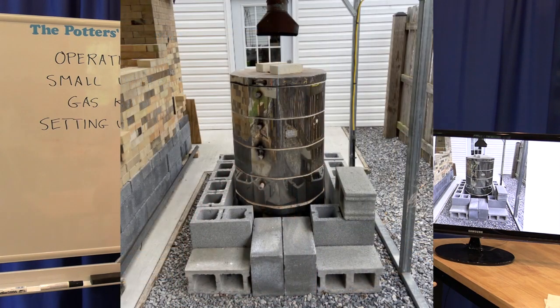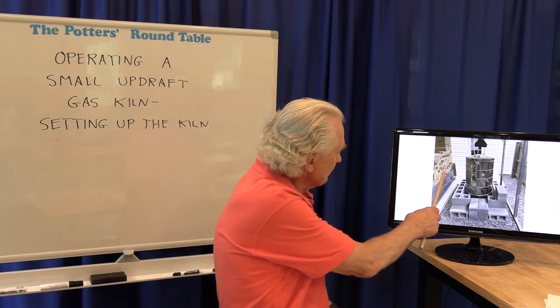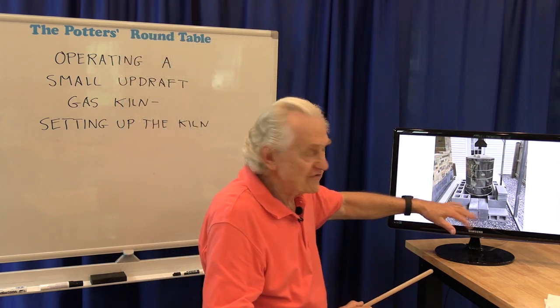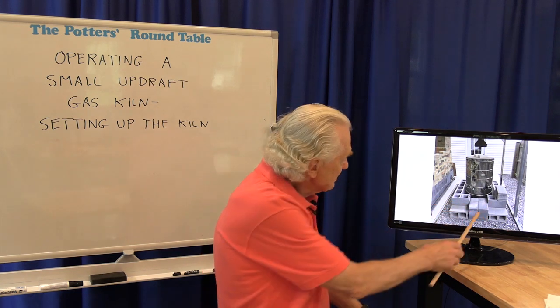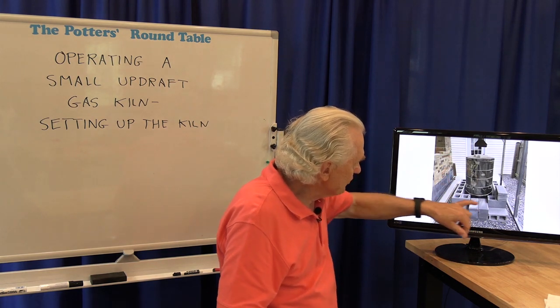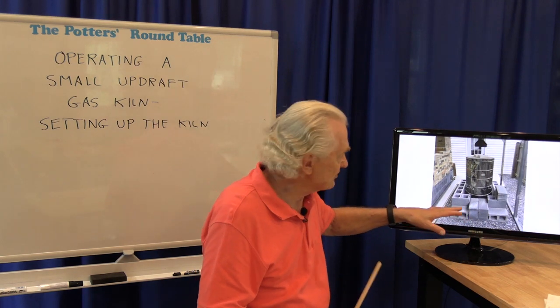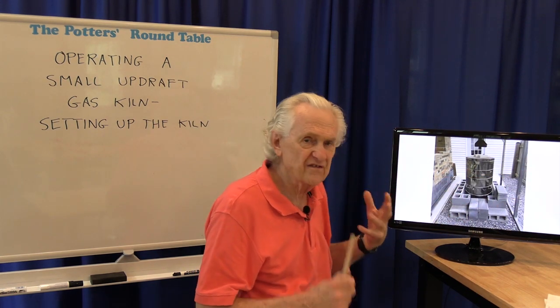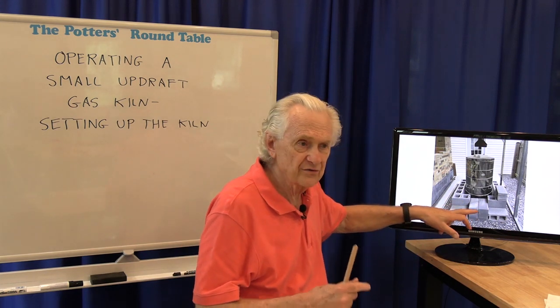Okay, currently the kiln is installed outside. We have an outside pavilion. This is our new soda kiln that we're building. But it's installed with the concrete blocks around it. Basically, this gives me a place to stand when I'm loading the kiln, but it also provides a nice block in terms of drafts, especially because it's outside. This is a fence here. But if it's windy, you could still get drafts coming in under the kiln. So this has worked really well to reduce drafts.